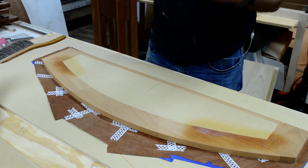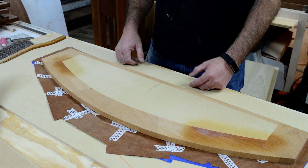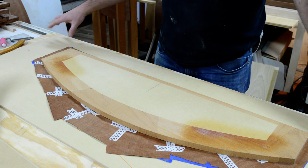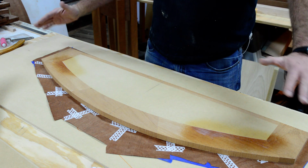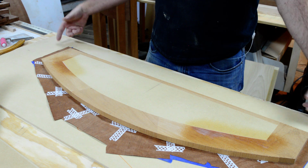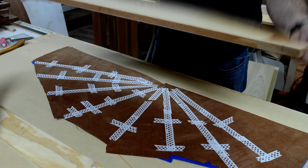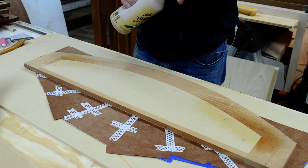So it's easier for me to lift the whole thing up using this material and just 1/4 inch MDF, and I could slide the whole thing in without worrying. I'm not going to worry about rounding off the corners on this thing, only because it's so thin. 1/4 inch, the bag is not really going to compress and really pinch and squeeze onto this thickness. If this was 3/4 of an inch, maybe even 1/2 inch, then I would start to worry about these corners, but this is great. This is just fine.